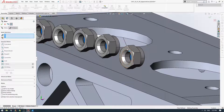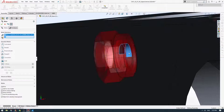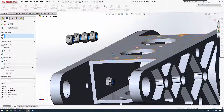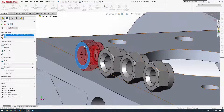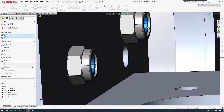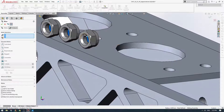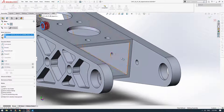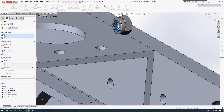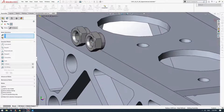We do that for each of the nuts. Although it is a little more time consuming than using the SOLIDWORKS Toolbox, it's still relatively quick and easy to do. The reason we're locking the rotation is that if we left it unlocked, these nuts would be underdefined — we want them to be fully defined, so we lock their rotation. Note that if you place these nuts in quickly you can flip them around by clicking this button — we can just flip the orientation. It doesn't really matter what orientation you place the bolts in first; you can always flip them later.